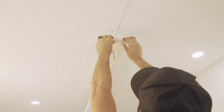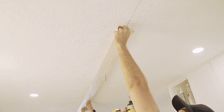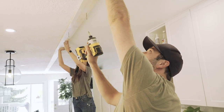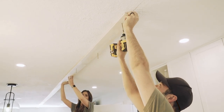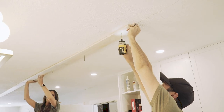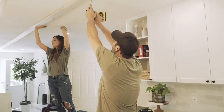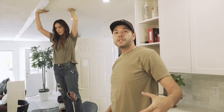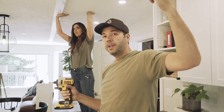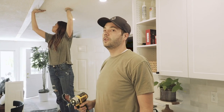Have somebody hold it and line the groove up there. I went and marked all the joists before, then held the board up and marked where they all were, and put screws in in advance. Then you just tighten all the screws in. And then the beams themselves, they just slip over top of that, and they get little screws on the sides that connect out. We'll show that next.